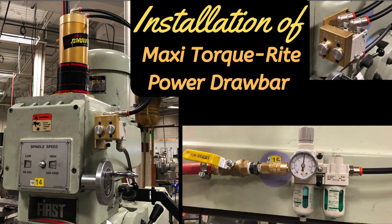The reason you install a power drawbar unit is for efficiency, but we are doing it for safety. The machines are quite tall and to put a wrench on you need a step stool or a ladder, which can be quite dangerous. Also, students are leaving the wrenches attached to the bar and turning the machines on, which causes damage and in some cases the wrench slams against the power unit which contains high voltage electricity.